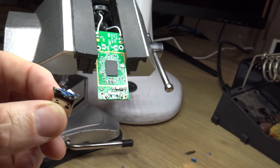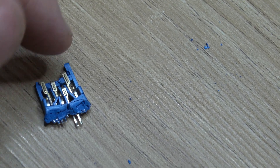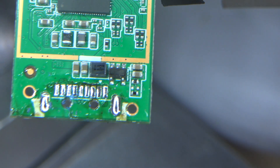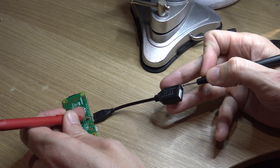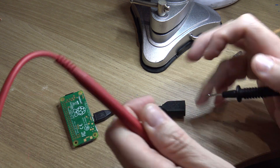Right, it now looks like I can get to the pins. The four pins of the USB port have one extra conductor in between all of them, so that's why there are nine on here. One, two, three, four, five, six, seven, eight, nine — yep. So I've got to go for those four and connect them to the board. Now I've got to figure out which one goes where on the Raspberry Pi. I can see those two pins there — that's that one, that's that one. I'll jot that down.